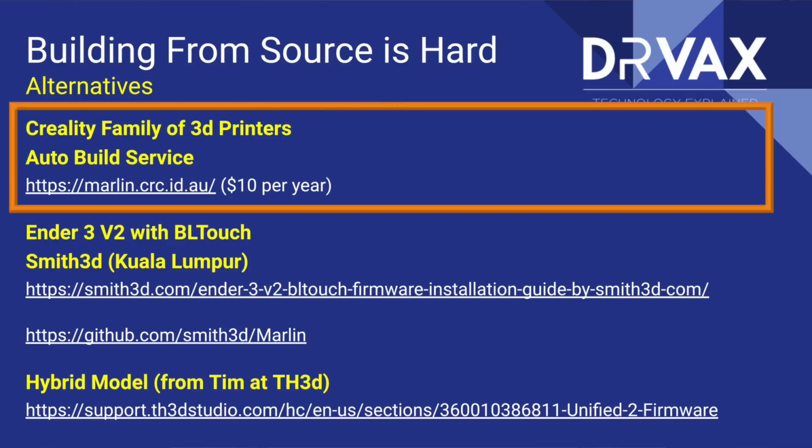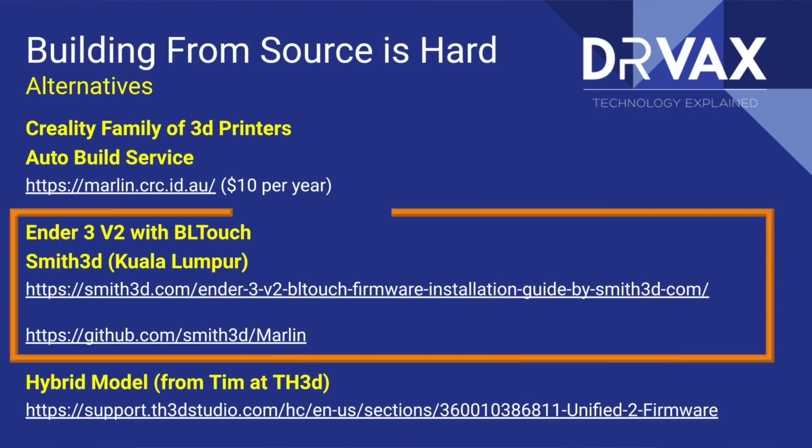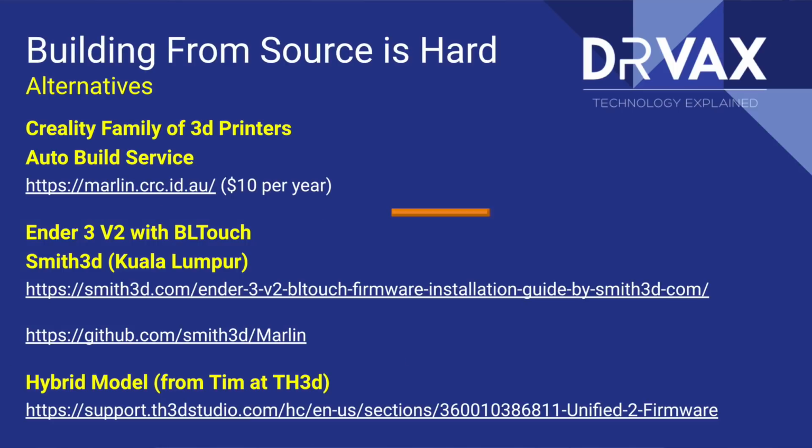If you're using a Creality 3D printer, the auto build service for $10 a year has firmware for a wide range of Creality 3D printers. And it's updated nightly in most cases. So you can just download the file, and as an example, if you're on an Ender 3 version 2, take the bin file, make sure it has a new name, put it on the SD card, and load it. If you're using an Ender 3 version 2 with a BL Touch, I think the folks at Smith 3D have an excellent build of Marlin with some extra features that make it easier to use your BL Touch. And I'll list all of these URLs in the description below.